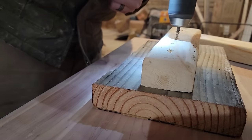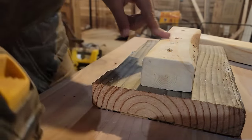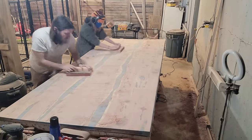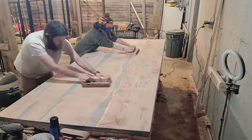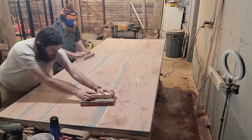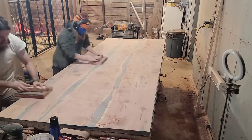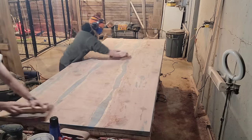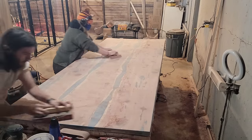As you saw, I tried using a belt sander briefly, and it did work to flatten it out some, but it was far too aggressive. Even using finer grits on the belt sander, it was still messing up the table because the edges of the belt sander would leave deep scratches in the wood. So I tried asking the internet for other suggestions to help fix the low sections and high sections of this table, the problem that I was having.